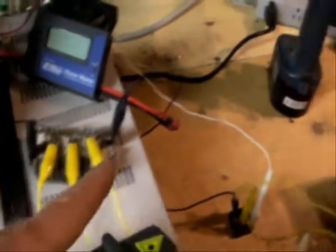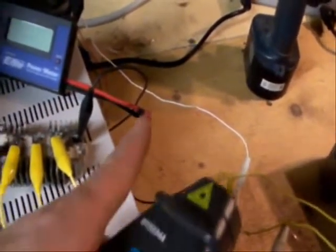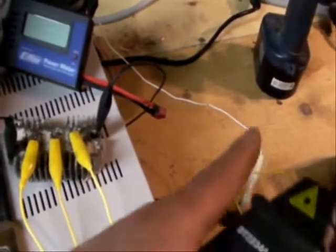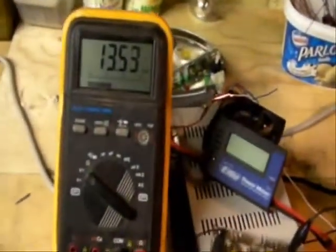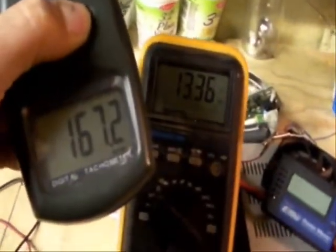And that's the bolt, and that's the 1 bridge rectifier, the 3, then the other one is way down there, and they're connected. From a plus, it comes up to positive, and then the negative connects to the positive. The white is the actual positive feed, and here is the negative feed, and they both hook up to the voltmeter. That's what we're getting. So let's see how many RPMs. So it was 175 at 14. Okay.